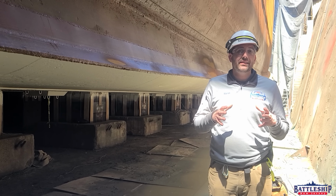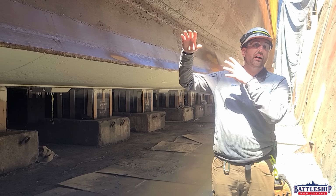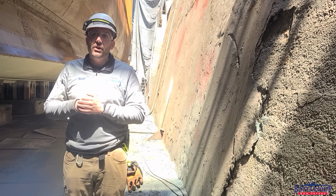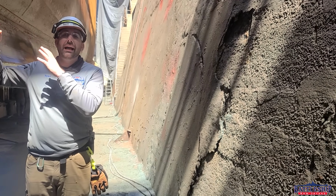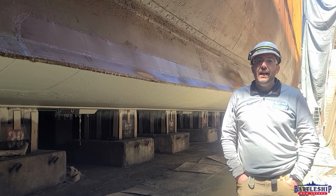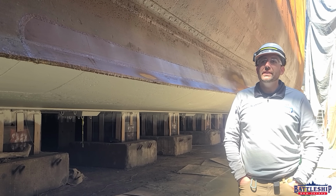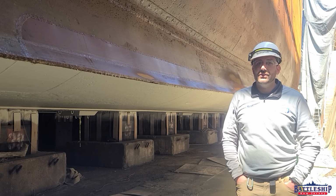The good news is that the system of coatings from 1990 were completely covering all of the pits. We didn't see any wastage of that coating that led to further pitting, which means that the hull has not corroded any further since 1987. And it means that a good system of coatings and the existing cathodic protection that the ship uses will be sufficient to maintain her for at least the next 30 years until we come back to dry dock.